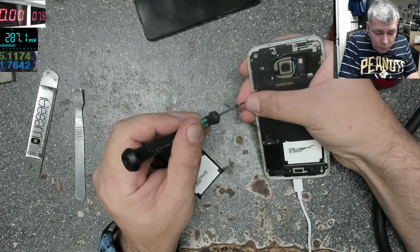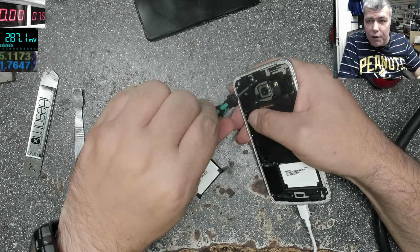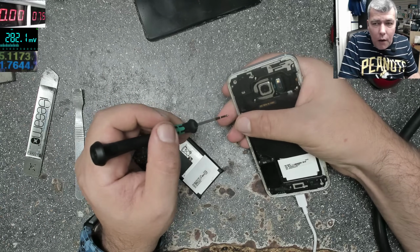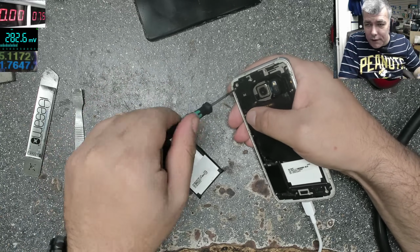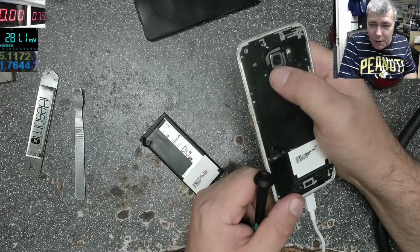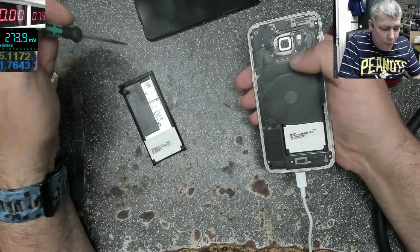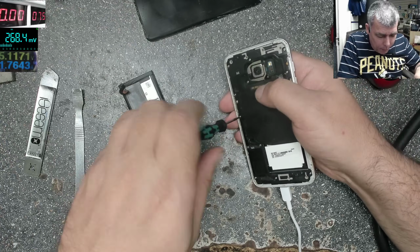And no, you can't find a way to check the battery capacity in a short time. It will take you hours. Whoever is claiming, actually selling a tester which can tell you in seconds how good your battery is, is lying. To find exactly the capacity, you have to discharge the battery and charge it. That's the way you can find the battery capacity.